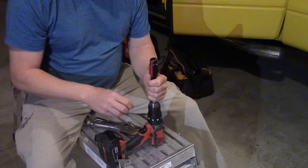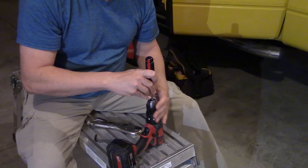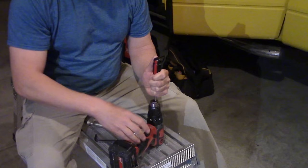We are in first gear — I want to point that out. You need to be in the lower gear, first gear. I've got a larger straight screwdriver in here; this Milwaukee M18 could also use a Phillips 3. Now this is a left-handed thread screw — slash bolt, whatever you want to call it — down in here. I have the drill in the forward position in low gear and we are going to use the strength of the drill.